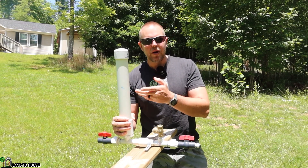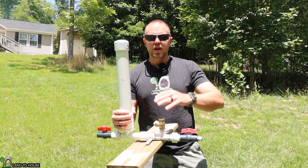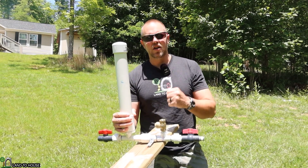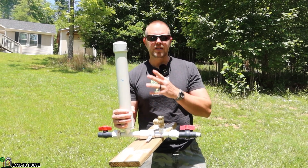The reason for that air pocket is to cushion the pressure wave — the water hammer — that's going into the pump. Otherwise, it's just going to hit hard and it can break things. It's a big mess.